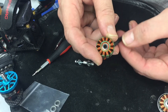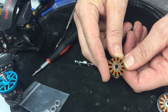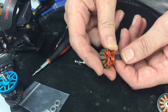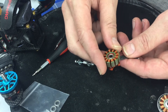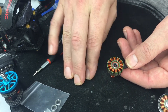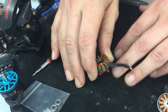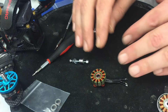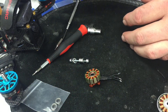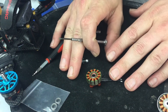Now for those who want a little more in-depth information, I'm going to go into more detail about a few things. A tip when removing the first bearing: this particular piece of material is suede and it's filled with BBs — this is called a shot bag. It works really well for hammering and hitting stuff on. It's what I use to bang the bearings out. You can also stack up some towels.